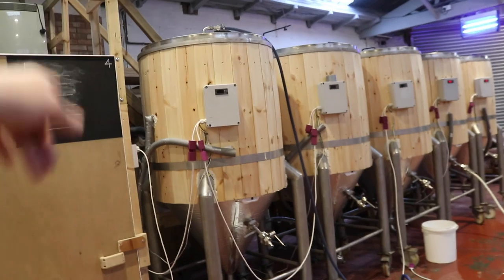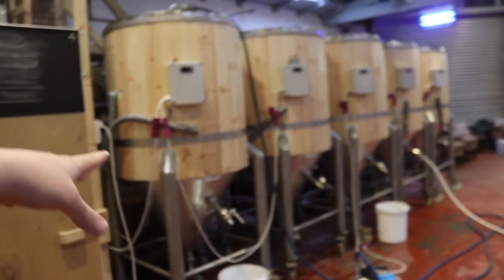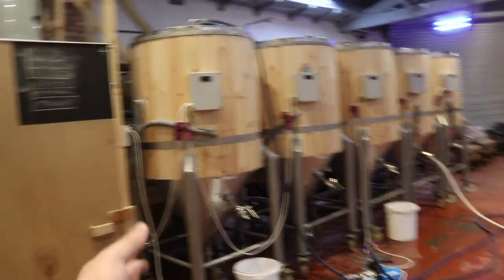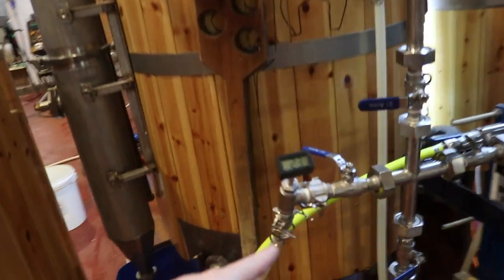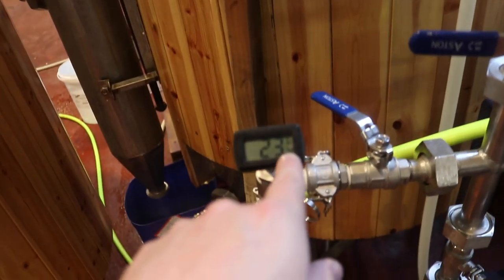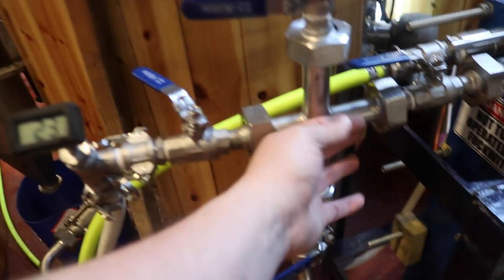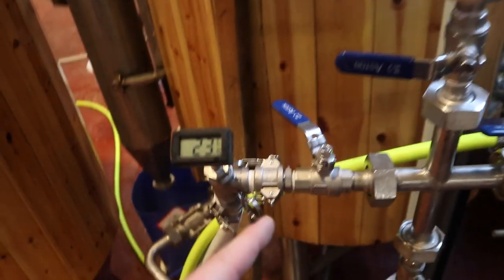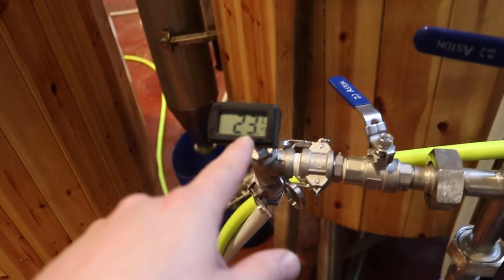So that tanker's got the beer stone in it, so we're recirculating nitric acid to get rid of that before we fill it this week. And over here I've taken the little gizmo that I made for the pilot kit to read the temperature on the output — instead of just using the rule of thumb, which I'm normally pretty close with — we now have a digital readout, and that's helping us no end.